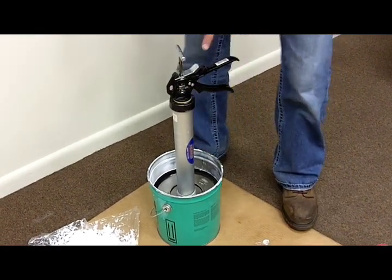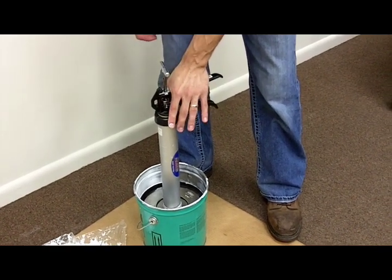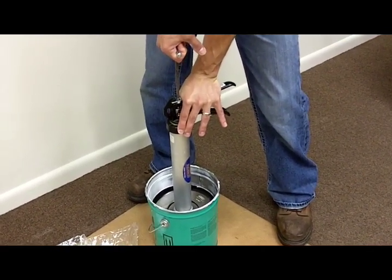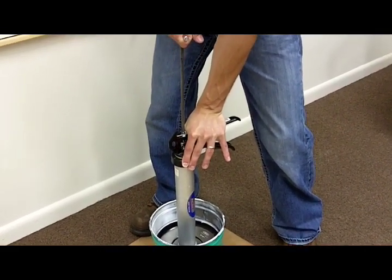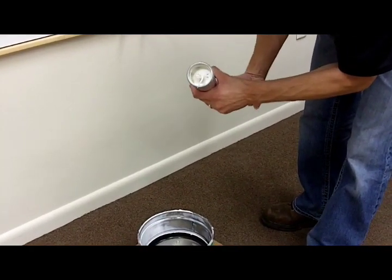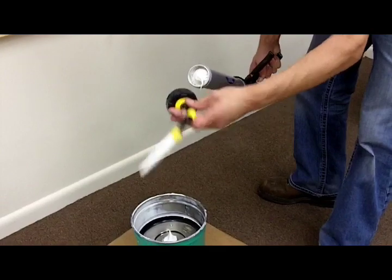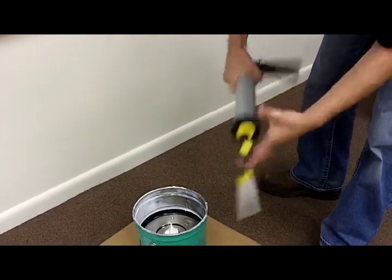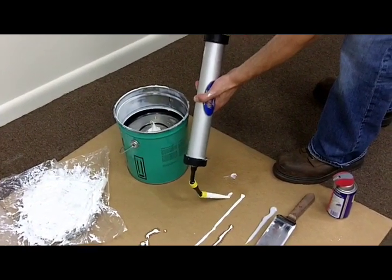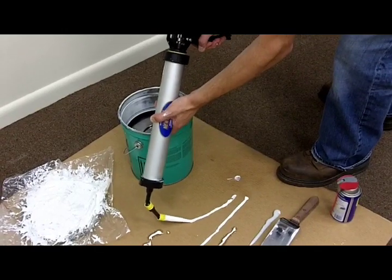You're going to simultaneously push down on the back of the handle while pulling the rod back, hitting the thumb release to do so. I prefer to put my hand on the thumb release and push down — a little easier. Make sure there are no air pockets. Simultaneously push down on the follower plate and pull back on the rod. Once there's just a small gap, you can gun the material a little bit to bring it to the front. Take your end cap with whatever cone you want to use — in this case the smaller bead buddy — and get the material flowing.